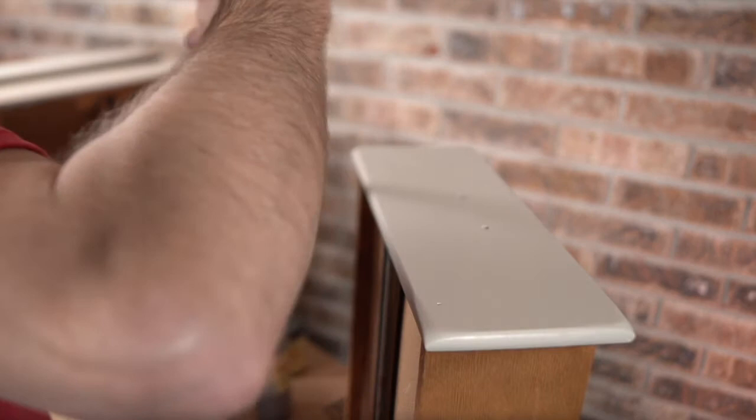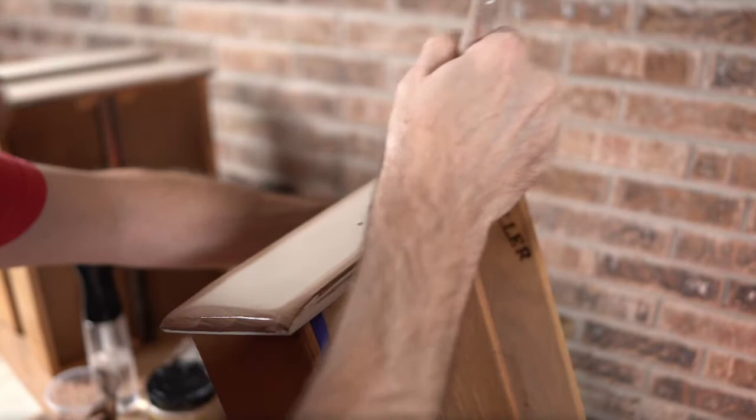So here we go again, missed it. I'm going to try and be a little bit more conservative with the gel stain, but it's not a perfect science on how much you can get on there. So just be prepared to adjust. Okay, then I'm going to take the Belle brush, smooth it out, spread it out, soften it up, give it its first blend.